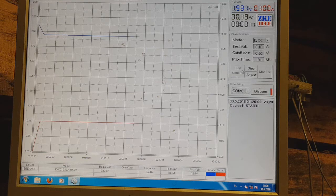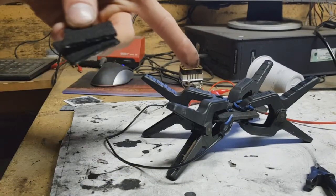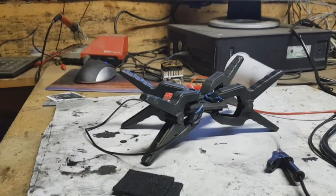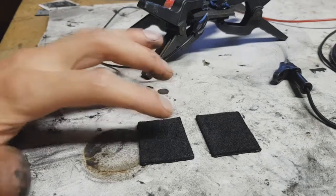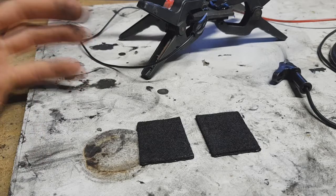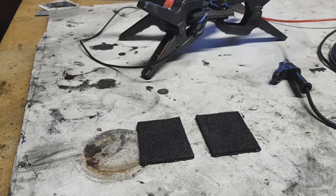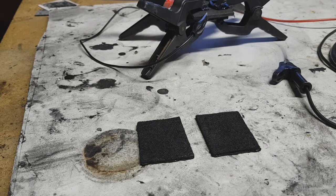In the meantime, I will show you my old electrodes which I use in this capacitor. As I said, the positive and the negative electrode are made from the same material. I use graphite carbon fiber for holding the active material in place. The carbon fiber also works as a conductivity network for the active material.